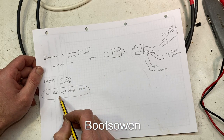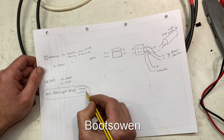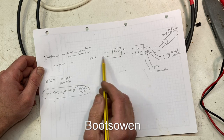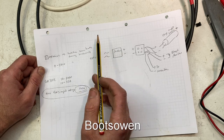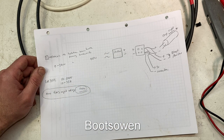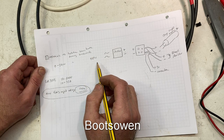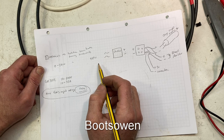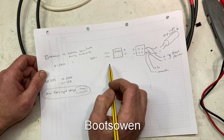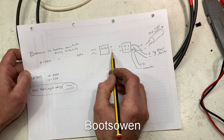What I've seen is that the max RMS input voltage on the rectifier is only 140 volts according to the data sheet, so I don't really want to run it too hot. The reality is I need an isolation transformer because we need to split the power coming into it — if they're both coming in I think it can confuse either my fuse board or the machine itself and you can have weird faults. It's worth checking out John Ward's video on why you need an isolation transformer when testing mains equipment with a mains oscilloscope, because you've basically got mains running in and out of the thing. The isolation transformer breaks that bond. So you've got two ACs coming into the rectifier, plus and minus coming out — positive and negative.